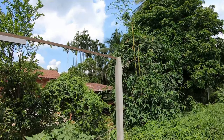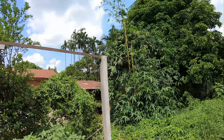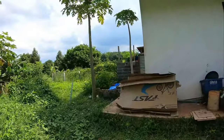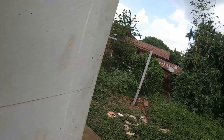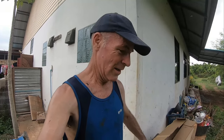Alright so let's get this concrete mixed up, get it in the hole and we'll let it set. The beam on the top is lined up beautifully — the beam will go through and bolt through in the two holes there. I've also got a piece of line I'm going to run through, just check it on the side of the house here. I hope you can see this line — that is within about two millimeters, which is fantastic. Spot on, good enough for me. Very happy with that — lines up a nice right angle. Wonderful.